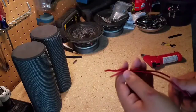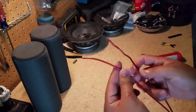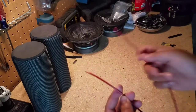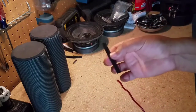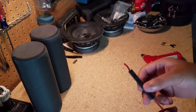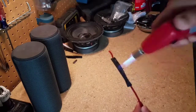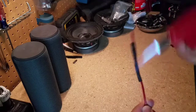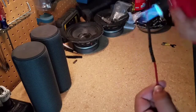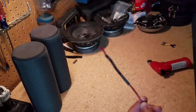I already cut the wires equally to match. Since I'm using the same color wire, what I'm gonna do is put a heat shrink on one of them so I can tell the difference between positive and negative. This will also be in the description if you guys are interested in buying some. Slide it over, get your heat gun or a torch, and heat it up. That's it. I left a little extra on this end so I can cut it off and put a terminal on top.